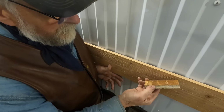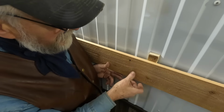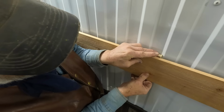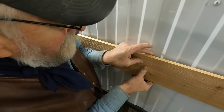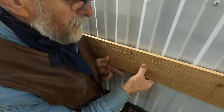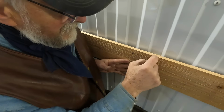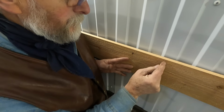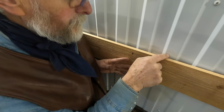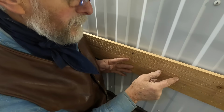And what I'm going to do is take some 5/8 material. This happens to be 5/8 OSB. I've made it an inch shorter than the 5.5, and this will fit in each rib. And then I'm going to fasten these spacers in behind this, which will set this out. So if a screw happens to come through too far, there'll be some leeway there to keep it away from the tin.